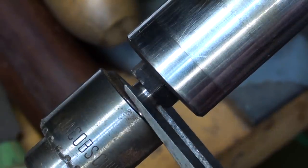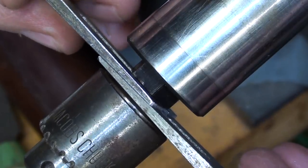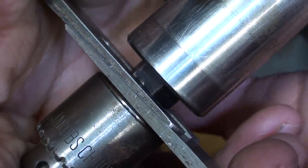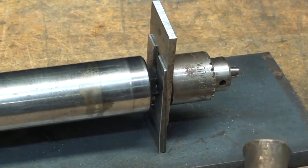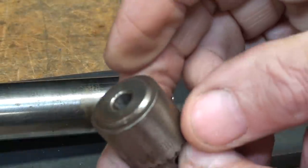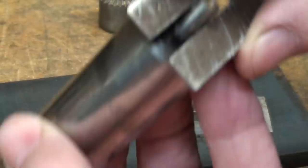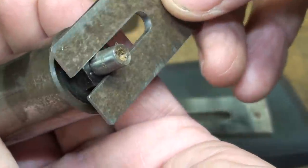I think you can see there's not a whole lot of room in there, but using them as a pair, trying to center them — that's the general principle of popping it off. Now how much force that will take, I don't know. Can I do it with my hands? I doubt it. Nope, we'll tap it a little bit. Wow, just like downtown — that worked perfectly! And there's a little number zero female taper. You can see how small that is — that's the very smallest Jacobs taper that they make, a number zero, and it just fits into my wedges. So I'm half done.